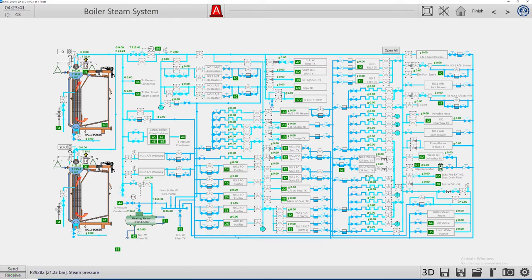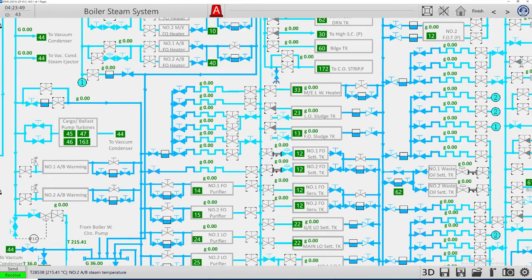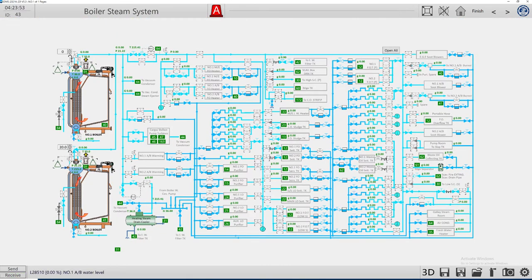Let's check our consumers — this is the overall view of the system. Here is our boiler which is pressurized. A normal step is also to pressurize or heat the other boiler by opening the heating line to it. We can also trace the steam flow: here we have steam flow for the heating line at the bottom of the water drum, showing a supply of 126 kilograms per hour.